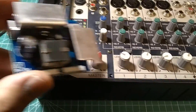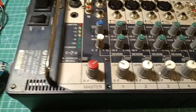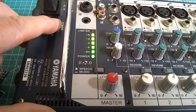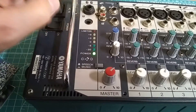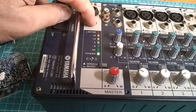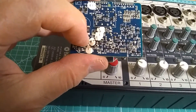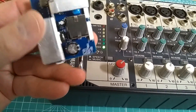I reconnected the boards without the damaged amplifier, which I'm going to fix by replacing the burned-out parts. Moment of truth — I'm going to turn it on and I'm looking for the power light to come on, because that was dead. Let's turn it on — and this is good, yeah! So it's going to be only one channel. You can see that one of the speaker outlets was also damaged, so I'm going to buy a replacement for that. I'll also get replacement MOSFETs and the SMD resistor — or maybe a larger resistor of the same value — and fix it up.